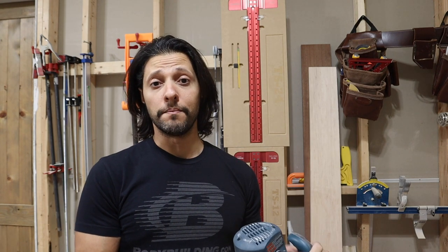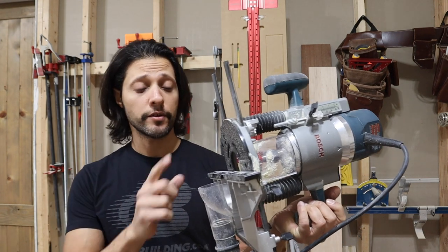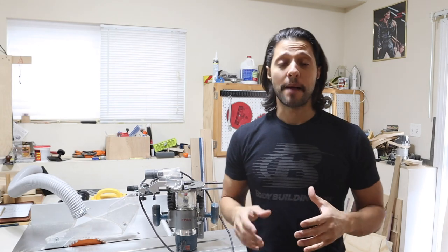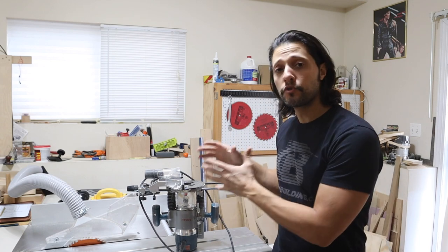In today's video, you win some, you lose some. In this case with the router, the edge guide, and the rabbet joint, he lost. Welcome back to my shop — today is going to be a little different. I told you about setting up the router with a straight bit, a three-quarter straight bit, running a rabbet along the edge of each one of the bottom boards for the barn beams, then dropping the side of those four beams into that slot. That's 100% true, but from a production standpoint it's a complete fail.